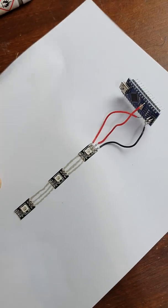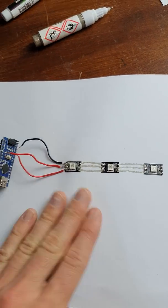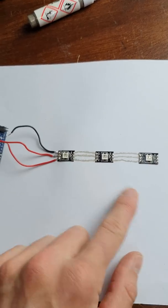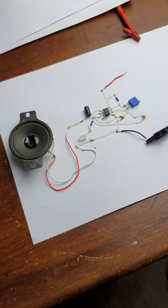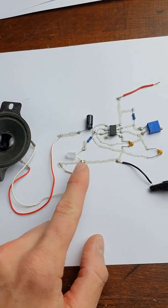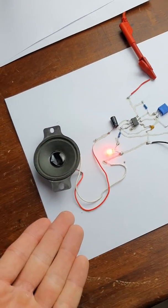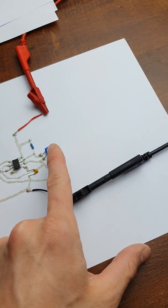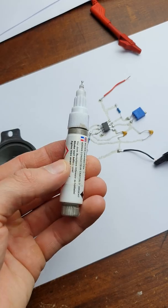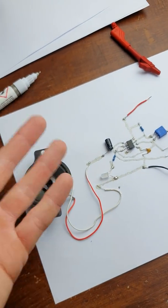I did more testing concerning frequencies - whether there are any problems when using high-frequency square wave or sine wave. That's why I did this small Arduino example with addressable LEDs, which use a high frequency to communicate - I think 800 kilohertz. At the end I did a proper circuit: a 555 timer circuit configured to spit out a square wave that you can not only hear but also see. Hooking it up - yes, it's a basic 555 timer circuit, it works just fine. You can adjust the frequency with the potentiometer. In the end this thing works better than I expected.